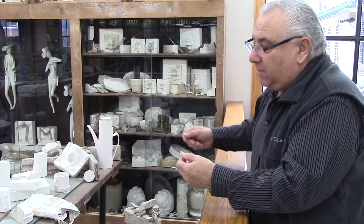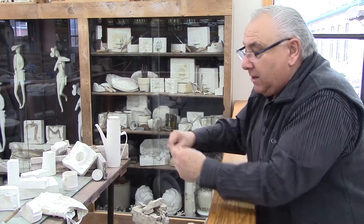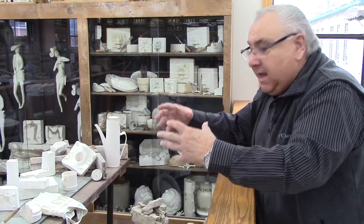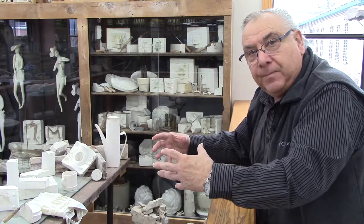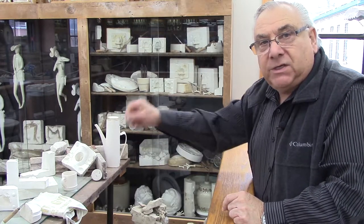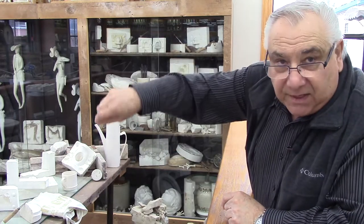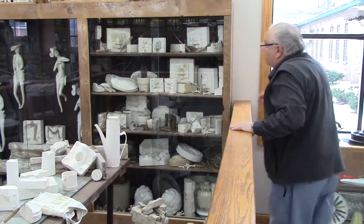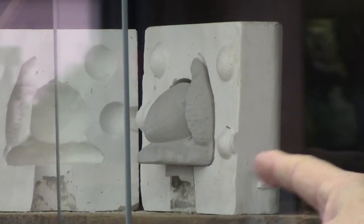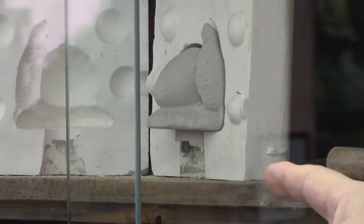In the casting department, what they did is pour liquid clay slip into the plaster Paris mold. The plaster Paris absorbs the moisture out of the liquid clay, adhering to the sides of the molds and making the form that was going to be produced. Once it reached the desired thickness — which is determined by the amount of time you leave that liquid clay in the mold — they'd pour the excess off and you'd get what we call the greenware. Here's the example with the badger on a football, and in here you can see the greenware that was actually produced out of that mold.